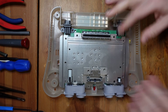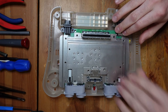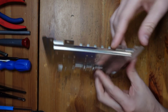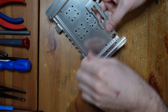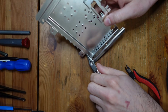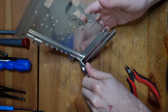We're also going to make some changes to the RF shielding. So here's the top RF shielding, and what we're going to be doing is taking this little flap of metal and removing it. The reason is because we need clearance for a flex cable to come up through here, and it's better to remove it entirely rather than bend it, just because the more space you have the better.